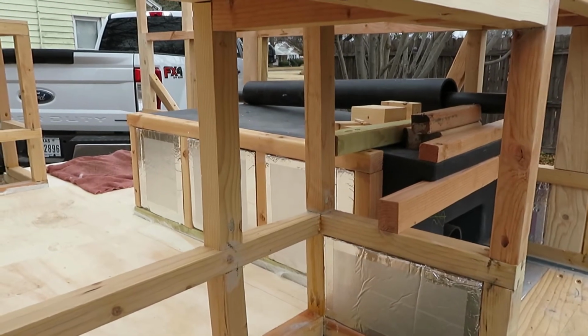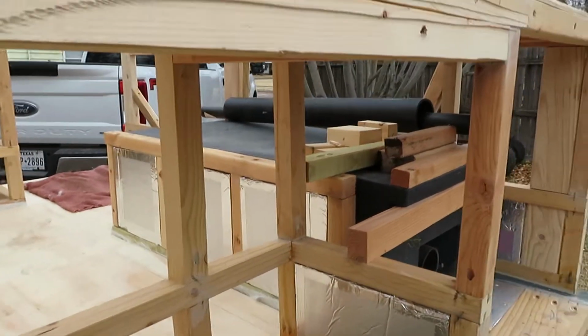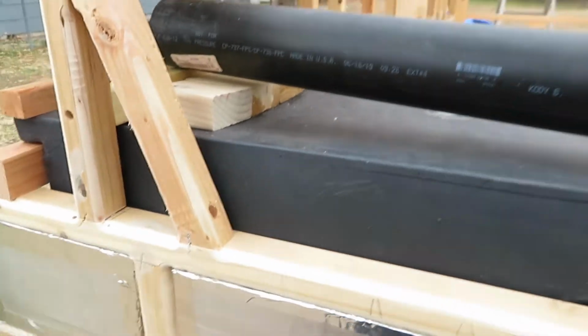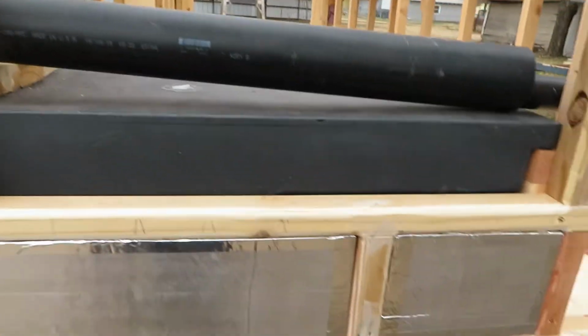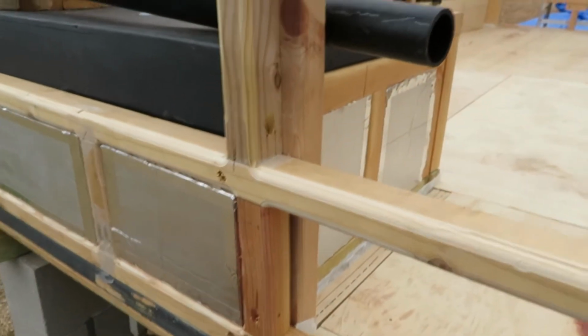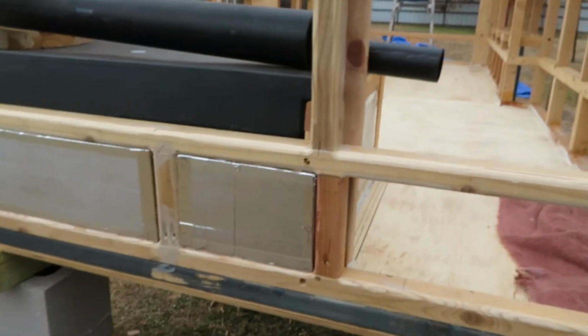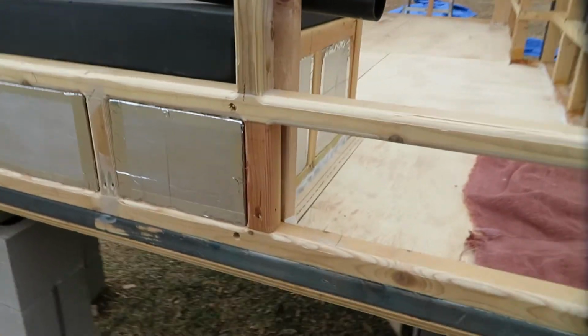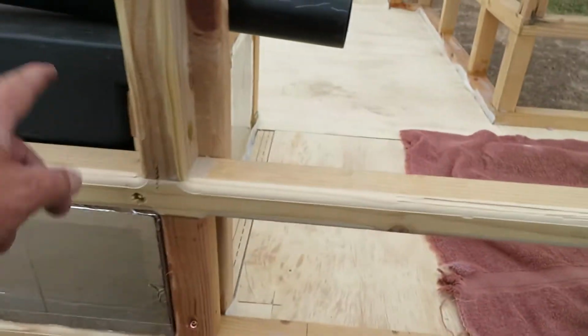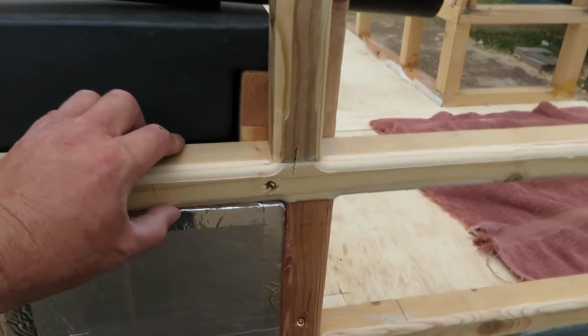And then I'll start my shower and everything on the outside of that, and overhang the top of the toilet plate, which will probably be 2 1/2 inch sheets or 3/4 going across, like I showed previously. These are just to keep the tanks from getting too cold, or the cold air from getting into the tank area. I will do this here too, but obviously it's going to be insulated anyways. These I just wanted to fit in here, have them pre-done or pre-cut.